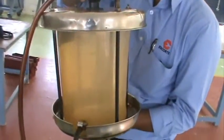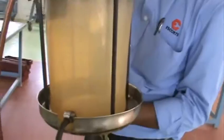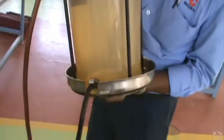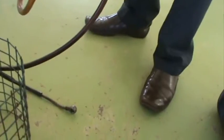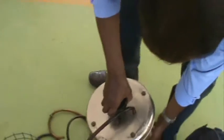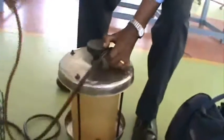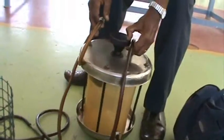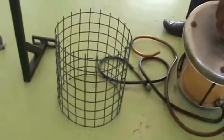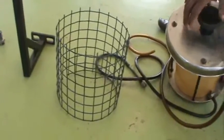Starting from item number one: this is the fuel measuring jar, which is a five-liter transparent jar. Divisions are given for each liter and each 200 ml. This jar comes with two pipes — one is the supply pipe, which has a banjo at one end for fuel supply, and the other is the return line for the tractor's return fuel. The jar has two plates at top and bottom for carrying, and a wire mesh on the side for safety.